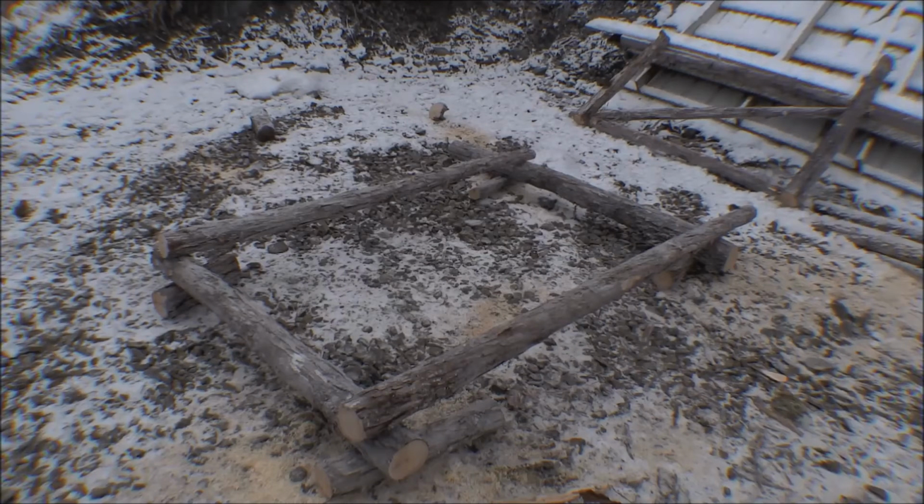And so I'll go ahead and do exactly the same thing with this one that I did with the other one. Just run the saw on them a little bit and kind of mate the pieces up together, or make seats for them where they'll fit together, and put some lags in them, and then I'll put a diagonal on there and square it up, and that side will be done. That won't take much there.